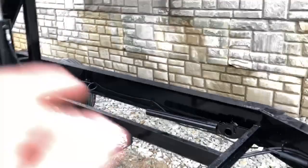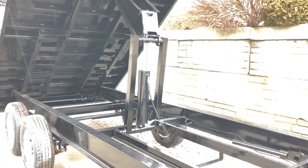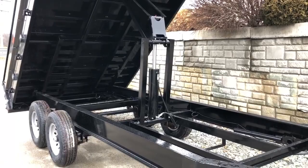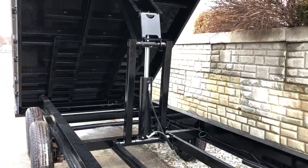It's also got a safety prop if you ever need to work on the trailer, and a guard for your scissor hoist. Speaking of the scissor hoist — this is a 14,000-pound rated trailer and that is a bit of an oversized hoist. Generally on a 14k trailer you would see a 516 scissor, but on this particular unit it's equipped with a 520. A 520 is rated in excess of the trailer; most commonly we see a 520 on a triple axle 21,000-pound rated trailer.